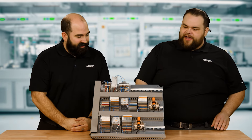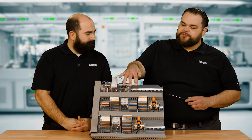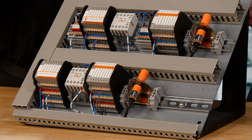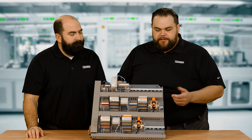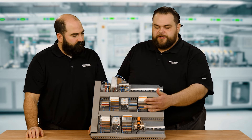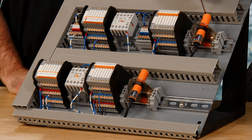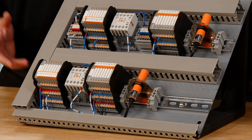That's exactly right. We have the same exact setup repeated on two rails — one with the Universal Relays on top and one with the Sensor Actuator Relays on the bottom. These Universal Relays are kind of the one-size-fits-all that can handle most applications. So on this one, we have a sensor wired into some relays, and then a contactor wired into some Universal Relays. When we sense metal here, we turn on a relay and it triggers that contactor — a very simple sensor/actuator application.